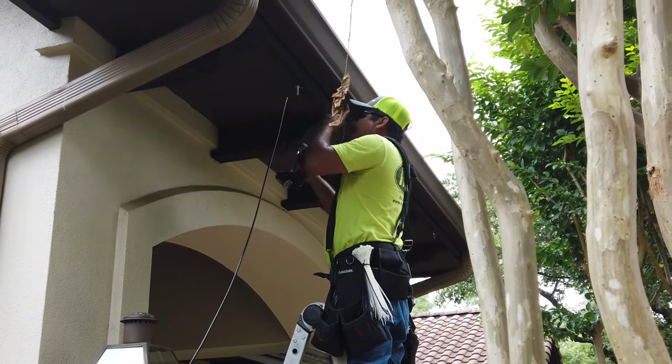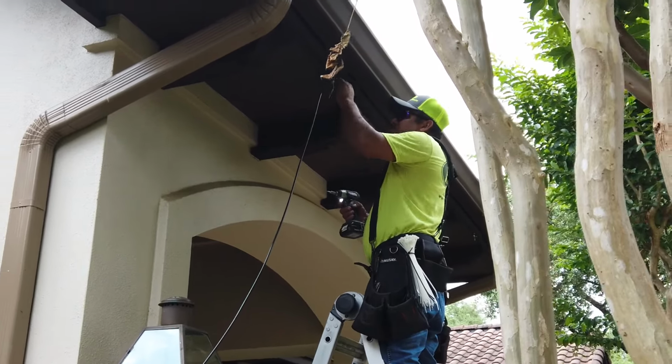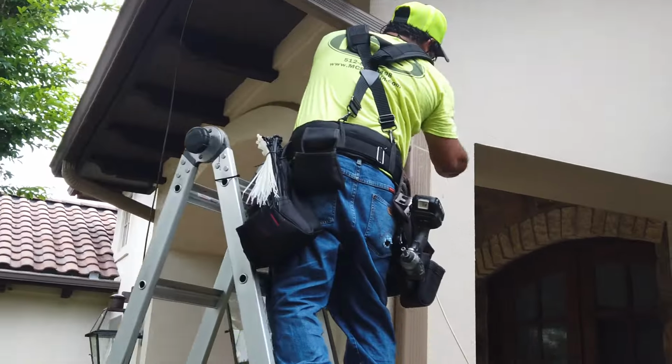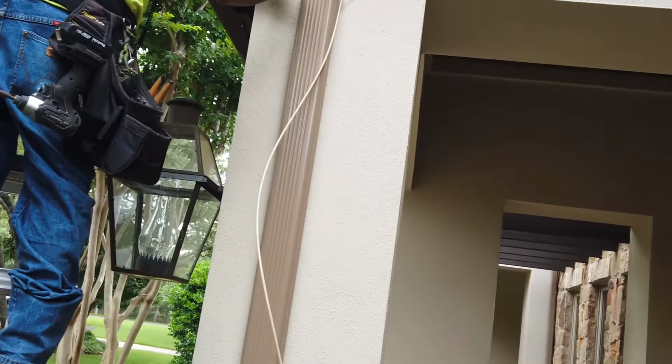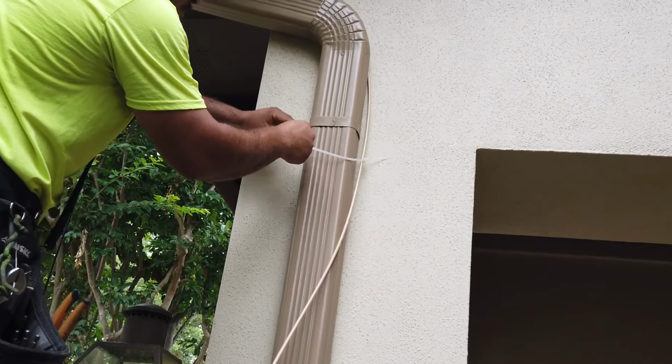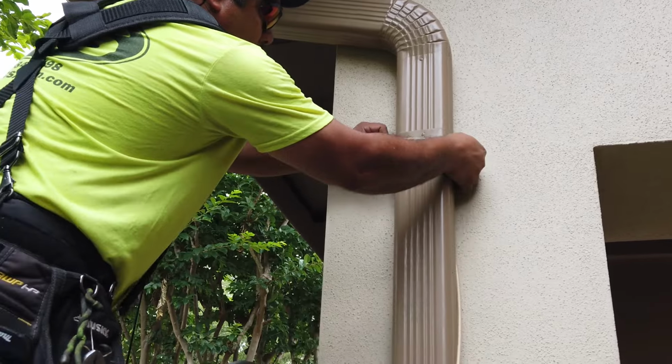For the patio area, getting aerial coverage is the best method, using eaves-mounted nozzles. In most cases, nozzles should be attached to the soffit where it meets the backside of the fascia to conceal the tubing. Then mount the nozzles and tubing around the patio and drop the tubing down the opposite side. If possible, use downspouts on gutters to hide the tubing leading up to the eaves.